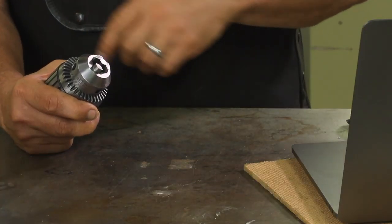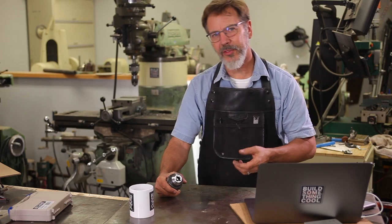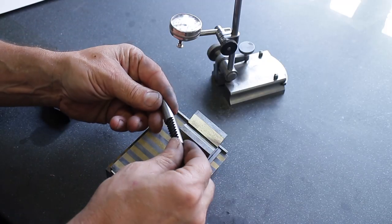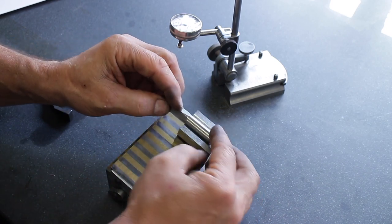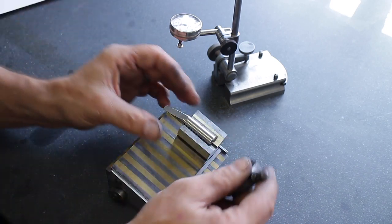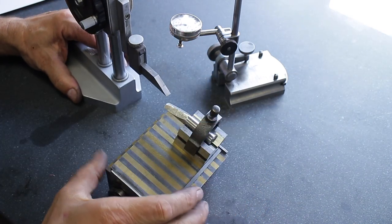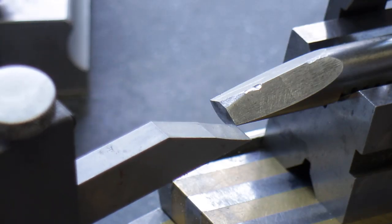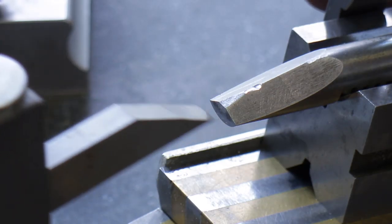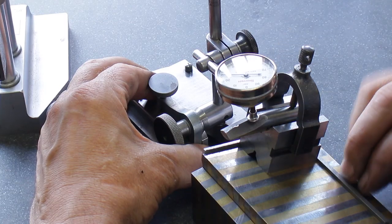I still think it's well worth doing, especially on a super chuck. When I first started this idea of grinding a chuck, I thought I'd take the chuck jaws out, set them up in some sort of bracketing system, and grind them on the surface grinder. But I really had a challenge in that I couldn't find a good datum point to really line it up on — I couldn't fixture the jaws consistently to be very repeatable. So that was really a challenge.